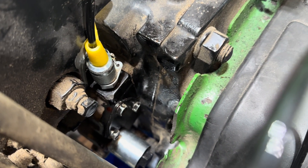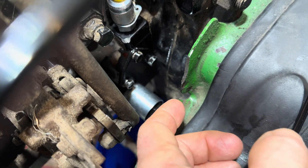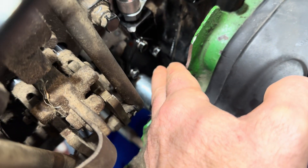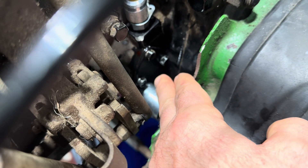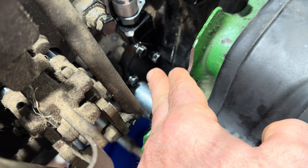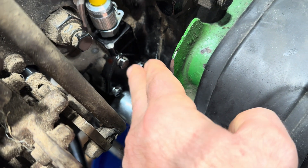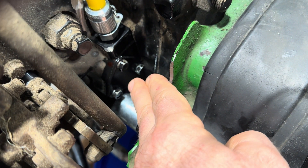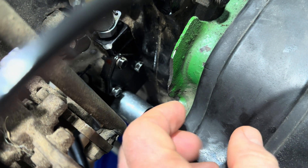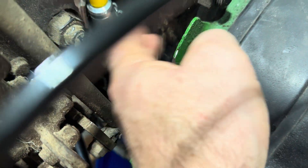The root cause of all this low pressure was a spool valve. There's a spool valve in here — these three screws, you pull this cap off, and then the whole valve is behind there. All you have to do is take the nut from here and pull off the outer plunger on the valve — it's about two inches long — and then within there, behind that plunger, is the spool valve. If that spool valve is stuck, you're going to get the pressure wherever it's stuck. For example, if it's stuck three-quarters in and out you might get 50 PSI; if it's stuck closed you might get more like 25 PSI, as in my case. To check it, push on it with your finger — take a quarter-inch extension, put it in there, and just push in and out on that spool valve. You'll feel it free up. It's just a little spring mechanism, and the spring pushes in further with more pressure and releases out with less pressure to control the on/off of the PTO.